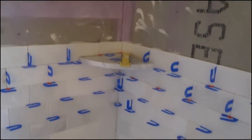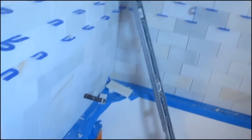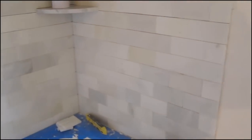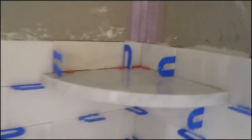The reason I'm doing that is because I am folding the corners. You cut the tile into the corner and the piece that falls off, you save that and you start the row on the next wall with that piece that came off the tile you just cut. That way, because these are all different shaded tiles, it looks like the corner is being folded.